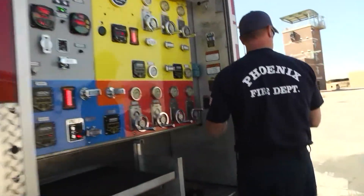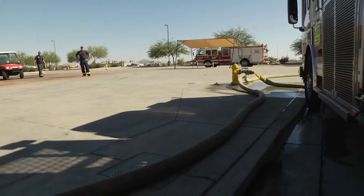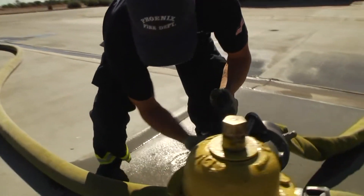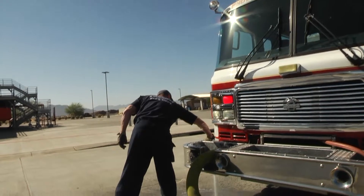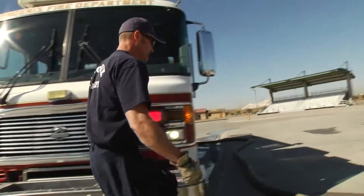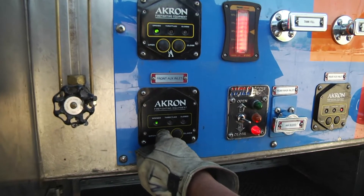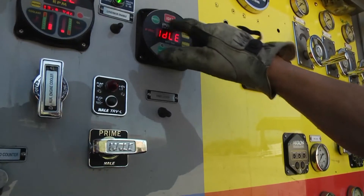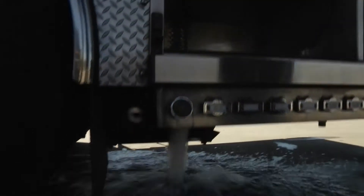Remember when you flake the line out, make sure you're away from the line when you intend to charge it. Check to make sure it's the right discharge — it's discharge number three. Charge the line at idle. Then go make the changeover, nice and easy. Go to the front of the truck where the bleeder valve is for the front intake, clear it, then back to the pump panel to open up your intake. When you open these electronic valves, hold them for about one to two seconds after they turn green to make sure they're fully open. Crack your tank fill and throttle up to the needed pressure, but not until communicating with the forward engineer. When the tank is full, close your tank fill.